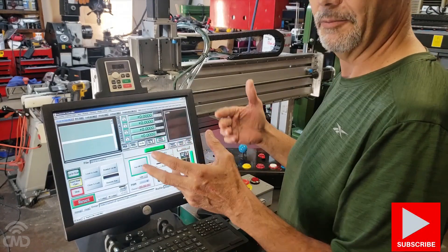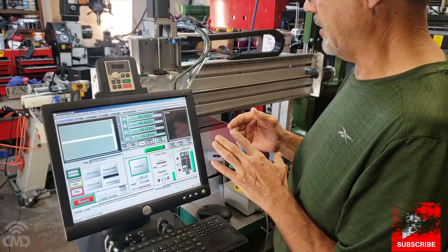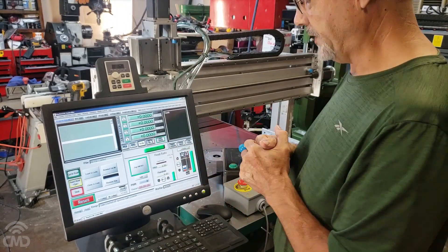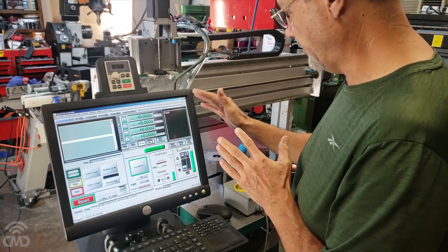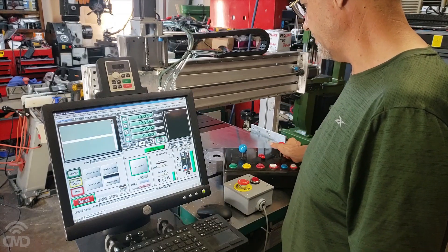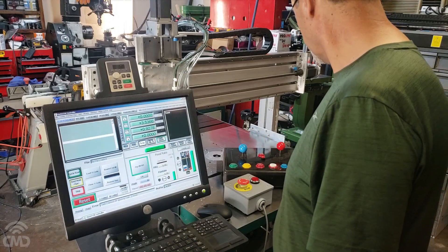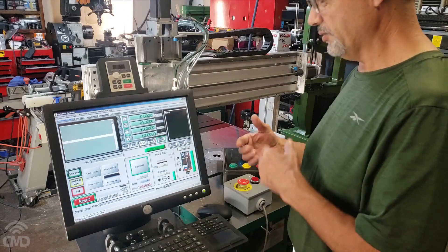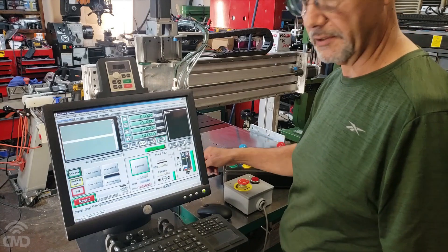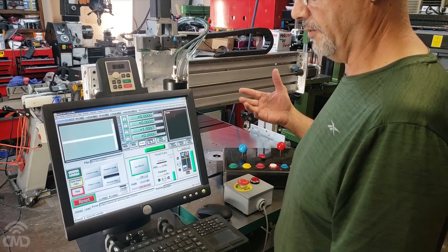You go to Z and it'll be exactly the right distance it's supposed to be, because now it's taking into account the switches to get that position. That's why I always want the machine to be right here in this corner. If I see my X, Y, and Z position and want to home the machine, I want the tool to be very close to this corner, so that's why I want this button to always bring it to that corner with a single push.